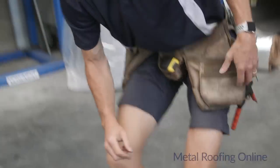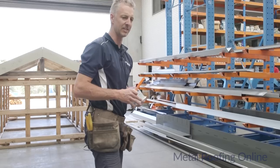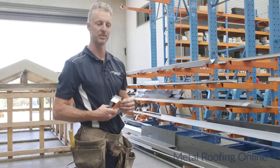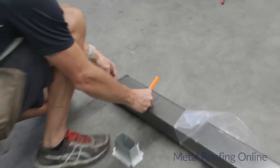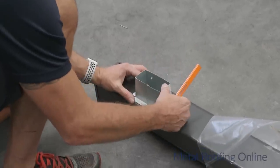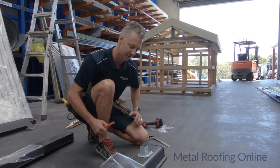That's our stop ends taken care of. Now we need to put the downpipe pop in. We worked out that we're going to make it 200mm from the end. I'll show you how to mark out the downpipe — we have done another episode where I show exactly how to do all the different sized downpipe pops, but I'll show you again anyway. So 200mm from the end is the centre of our pop, and I usually centre it on the gutter — it just makes it easier when you're cutting the lines.